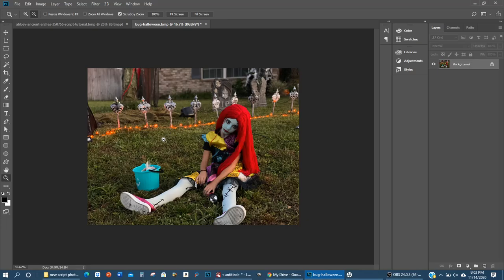There's only one spot-on result somewhere in the haystack of all the settings. Asking somebody for their settings is probably not the best idea, especially for photos, because everybody's machine is different — different wattages, different tube ages. Even if they have the same machine as me, their settings aren't the same because mine will fire at 2% minimum power and theirs might fire at 8% minimum power, so there are a lot of variables that determine the actual laser output.